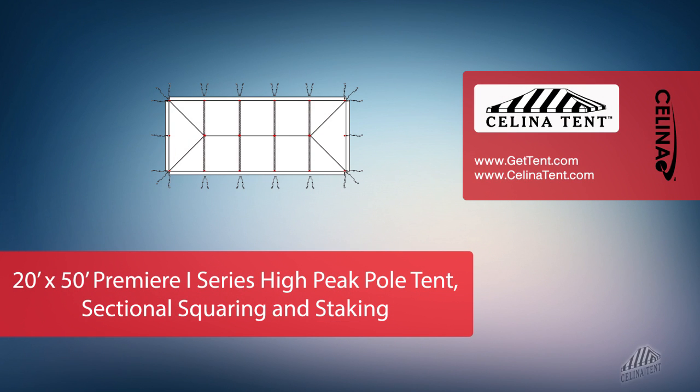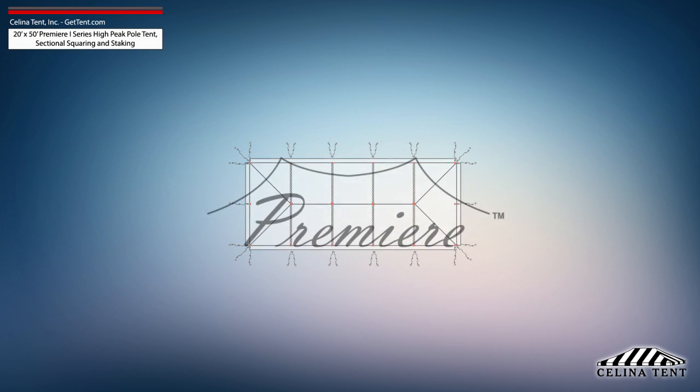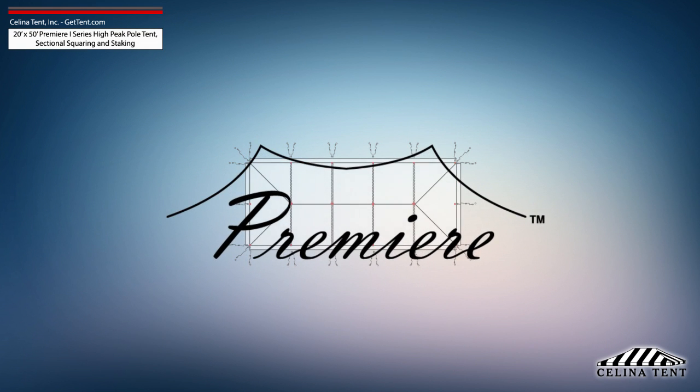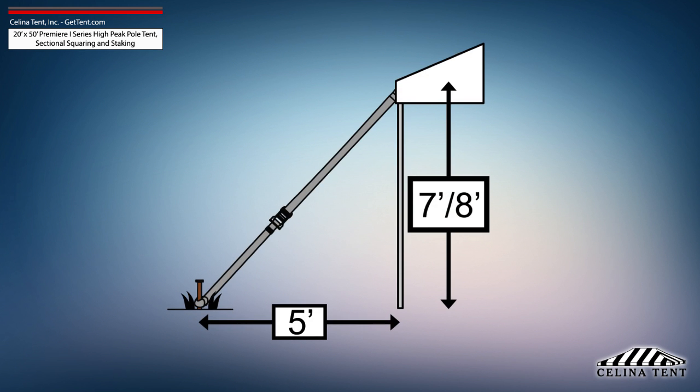This video covers squaring and 5-foot staking applicable to a sectional 20-foot by 50-foot Premier 1 Series high-peak pole tent from Celina Tent. 5-foot staking is standard for tents with an eave height of 7 or 8 feet and would need to be adjusted for eave heights other than this standard.